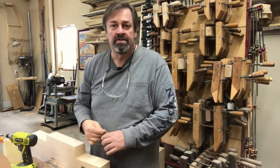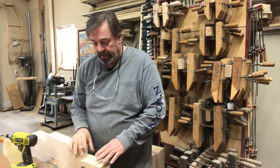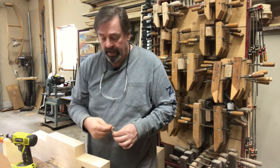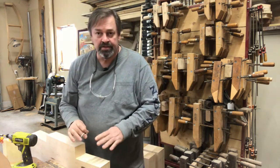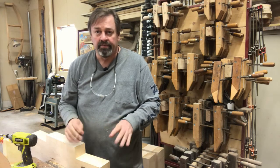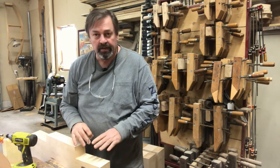Now that we're back from the bandsaw and our legs are all cut out, we can go ahead and get those glued onto our bottom body block. To do this, I like to use 2.5-inch screws with 1.25-inch fender washers. Once the glue's dried, I'll go ahead and remove the screw and the washer. I'm not concerned at all about the hole it leaves behind, because we're going to glue muscle blocks over top of that, so you'll never even see that hole. So we'll get some glue put down, and we'll get our legs attached.